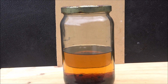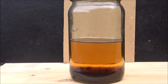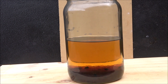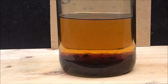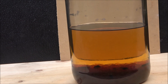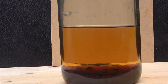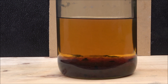Here's the same petrol — homemade petrol recovered from pyrolysis oil — and you can see the changes. The clarity has improved. The silica gel became much darker; it's no longer white crystals, it's brown crystals now. It's still semi-transparent, but all the cloudiness was removed. We're going to keep it for another two days and check it again after tomorrow.